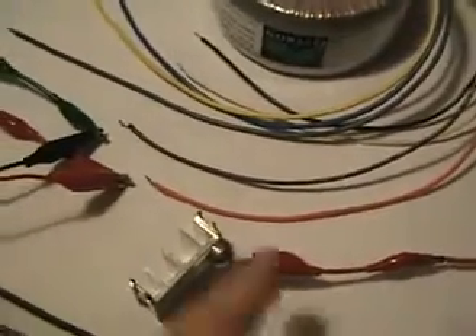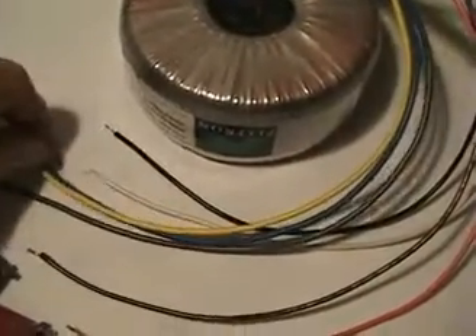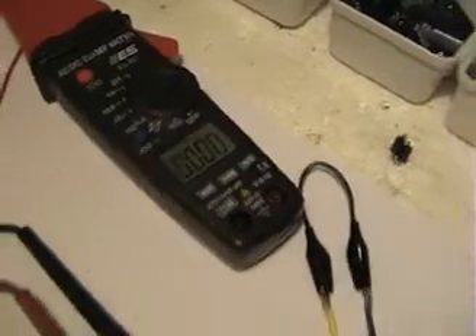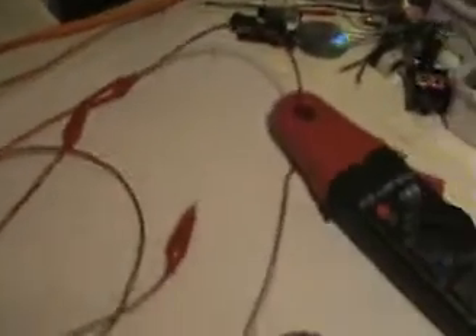The 110 outs are going to be going to this bulb here, and there's a free set here of 110 outs I'm not going to use. There's my voltmeter now set on DC volts on the scale of 20 volts, and my amp meter's ready to go. I've got some deep cycle batteries down there, one of them hooked up, so I'll be using 12 volts coming into this circuit. I'll turn on the 12 volts now.